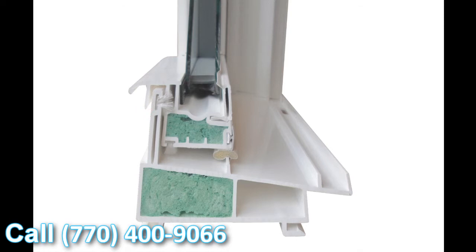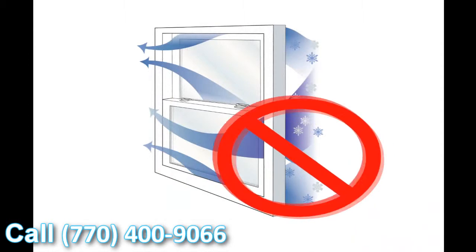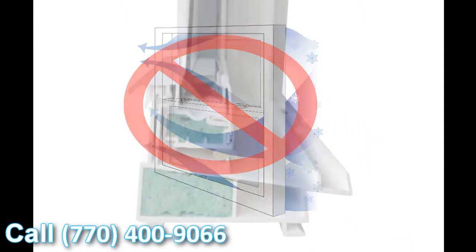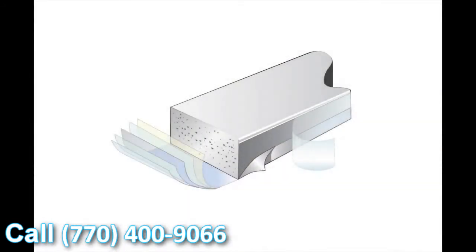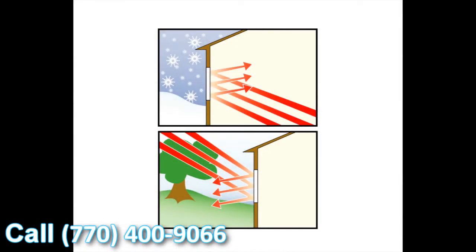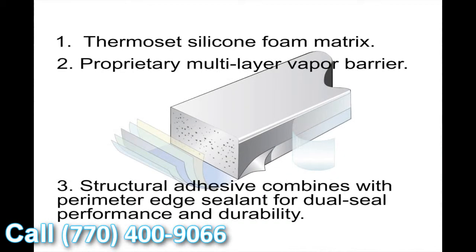Great theory — but let's be realistic: air and water is just not going to make it towards the inside of your house. Finally, the last feature is the super spacer system. The great thing about super spacers is it's a non-metallic glazing system, so there's no transfer of heat or cold. On top of that, it's the only dual seal glazing system on the market today. So it gives you great energy performance, great protection against heat and cold conductivity, and a great overall window U-value.